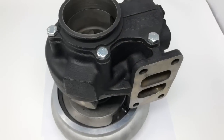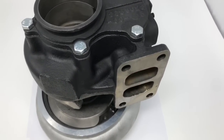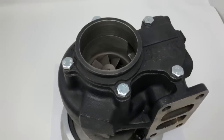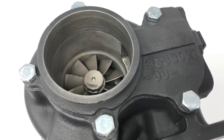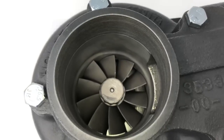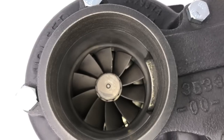Here's a look at the back side of the turbo. We resurfaced the flange here — usually they get really corroded, so we go ahead and take care of that, and then round the edges to prevent any cracking. This one has a 14 cm exhaust housing. There are a couple of variations of the exhaust housings for these; the most common, I think, is the 12. The upgrades are all the same for each one.